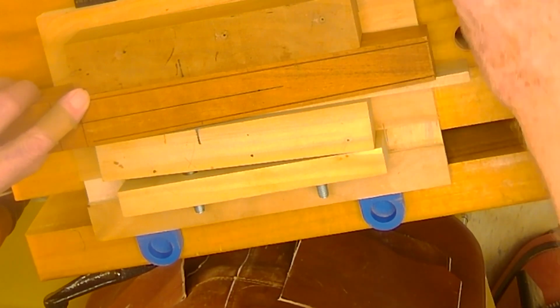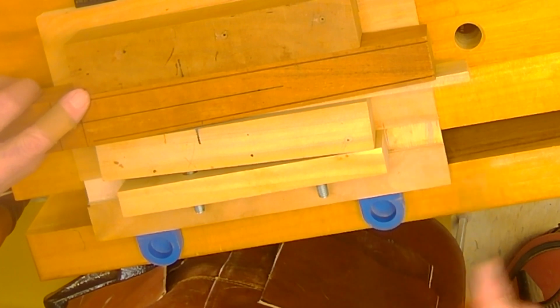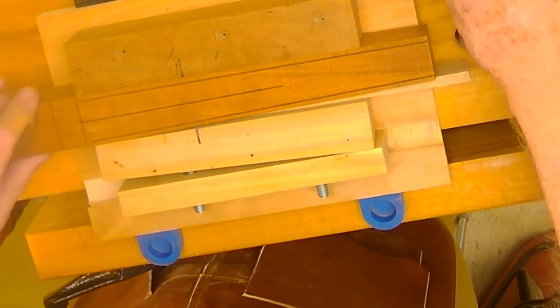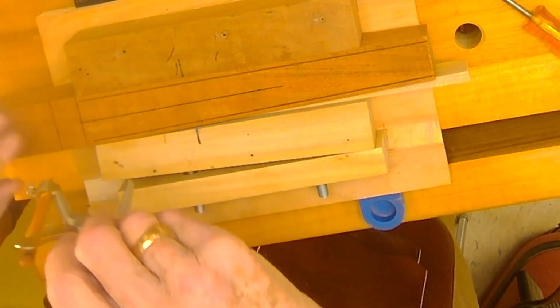From where you want to start. Okay. And then you strike an arc 3 1/4 inches away from where you want to end up. 3 1/4 from both sides. Okay, I got you now. And then you put your compass on that. Right there, yeah. That intersection. Let's double check. Go between those two. Gotcha. That makes sense. Thanks. That's good.